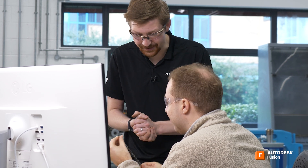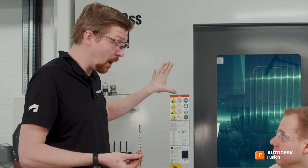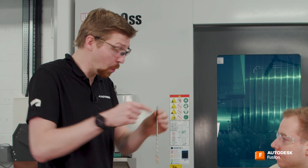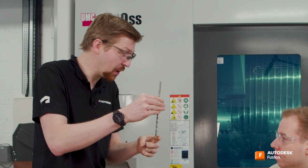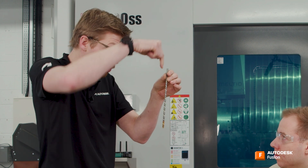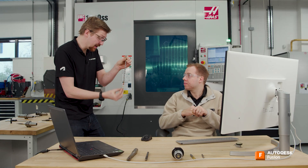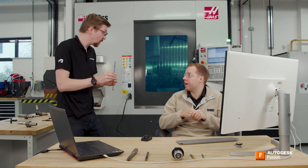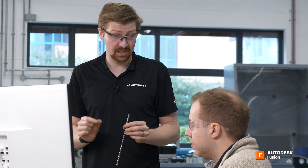This tool has tiny holes at its front end — it's through-spindle coolant compatible. Some machines can blast coolant not just around the drill but jet it down through the tool all the way to the cutting tip. That cools the tip effectively and forces all the swarf back up and out of the hole, solving both problems at once. With this setup you can drill the full depth in one go, which is amazing for tool life.